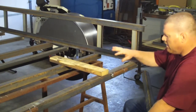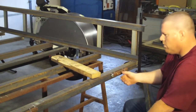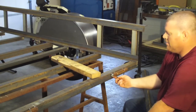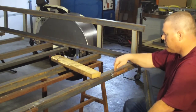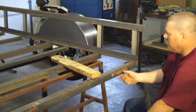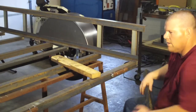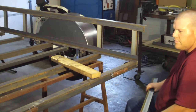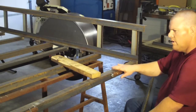Now that I have the hinges tacked on, I want to talk about welding. Make sure you get welds on the top and the bottom of the hinge so it's not going to peel off. Try not to get anything on the other piece — you don't want to accidentally weld the spinning one down. That center one only gets welded to your ramp piece.